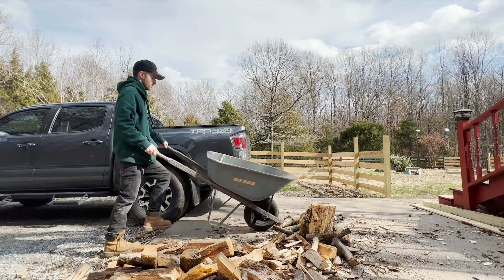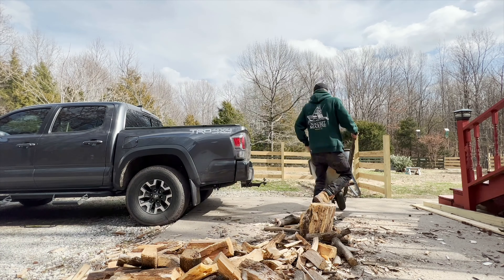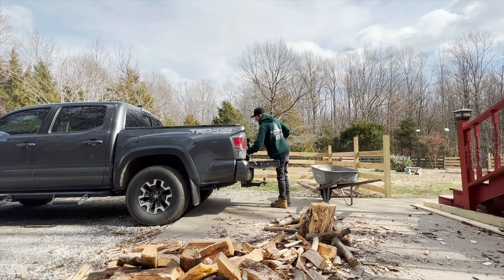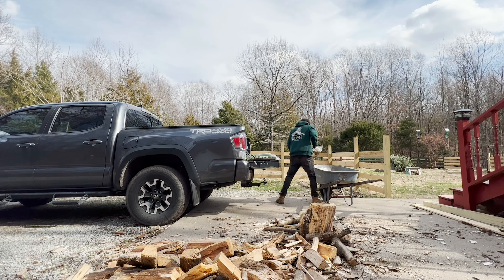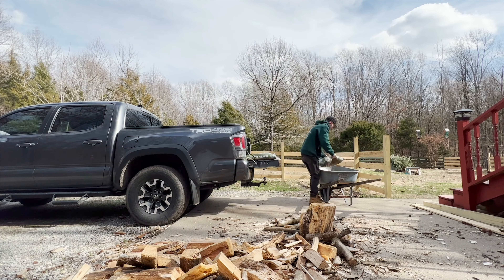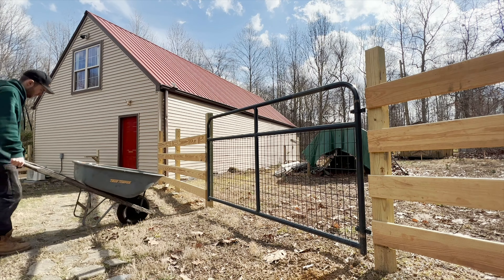You'll see I also dig one side slightly deeper, so that if any water pools below the ballast, it'll flow away from the ties and down towards the drainage underneath my trestle pitch. My goal is really just to dig down below any roots to thoroughly clear the weeds and vegetation and to remove all of the porous topsoil. For the beginning of this project, I've opted to use bagged ballast for a few reasons. I don't have the site of my future gravel pile cleared yet, and since I want to keep the lawns surrounding the shops intact, moving and pouring bagged ballast is just much easier right now than slopping a truck all over my grass.